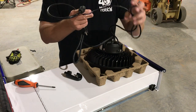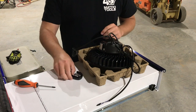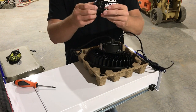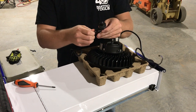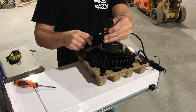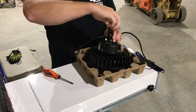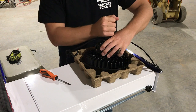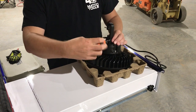Now you've got your 110 lead connected to your high bay light. We're not going to do anything with the dimmable — we want everything at full speed 100% of the time, so we're just going to leave it as is. What we're going to do next is screw in our hanger. It's just a simple U-shaped hanger with a secure bolt on top. It comes with a thread protector from the shipper, so we'll get that off and screw it into the housing. After screwing in the hanger, the company was nice enough to include a set screw to tighten down and lock it into place.